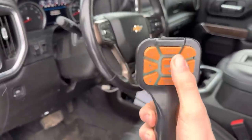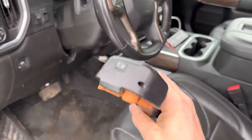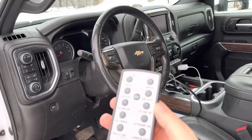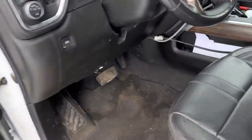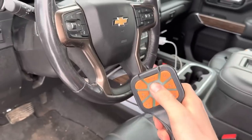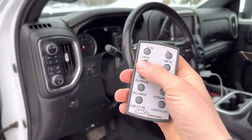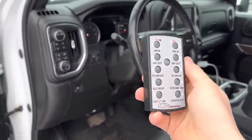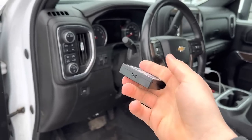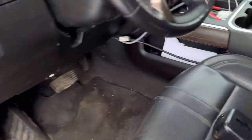So here's the controller I've been using for the front plow. It's super easy — up, down, left wing, light bar, transport plow. Super straightforward, on/off. And then I've been using the wireless one. I like the wireless one for the back plow just because I don't have to deal with the cord. Because all the buttons are the same on the wireless one, it's kind of hard to distinguish. Whereas on the wired controller, you know the middle one's up and down. You don't really have to look at it to run it. The wireless one just takes a little practice — one down is left wing out, top is wing in. I've barely ever charged it and the battery holds really good. This is what I use — wireless for the back, wired for the front. It's been good.